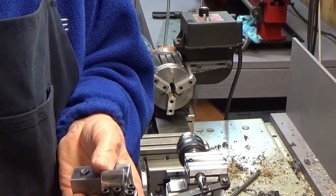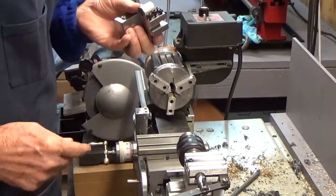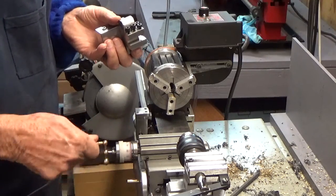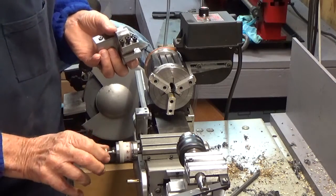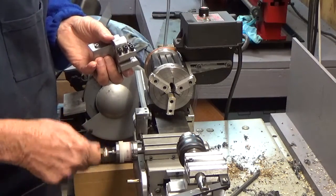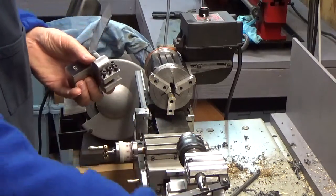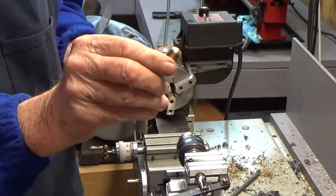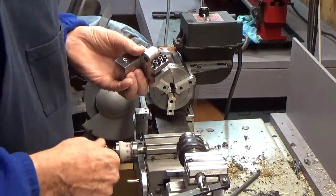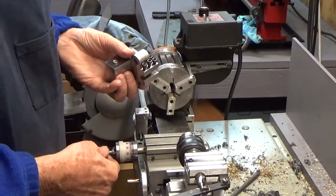I would have had to make a few of those in order to make this little ball crank here. But it would have been easier because I had it chucked up in the lathe and I just had to form all these radiuses by hand, which worked okay too but it took a while. This would have been much faster. With that little tool, I cut a piece of brass this morning — that took about 30 seconds, just peeled right off there. I could have made it out of steel, but I didn't because I knew doing it by hand was going to be hard, so I just made it out of brass. That worked okay.